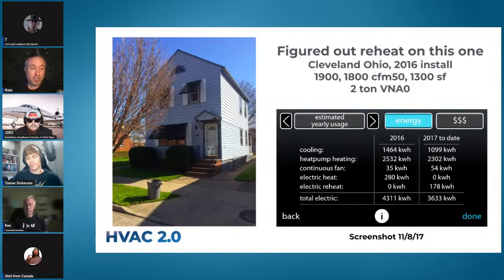Non-communicating mini-split outdoor units — which is nearly all of them right now, except Daikin which is communicating — can't control indoor coil temperature and don't dehumidify. You can learn this the easy way from me now, or go put one in and then install a dehumidifier afterward. I'm actually really worried about federal IRA incentives for heat pumps because the cheapest qualifying products are often these types, and we're going to get a lot of people sick and ruin a lot of houses with poor dehumidification.